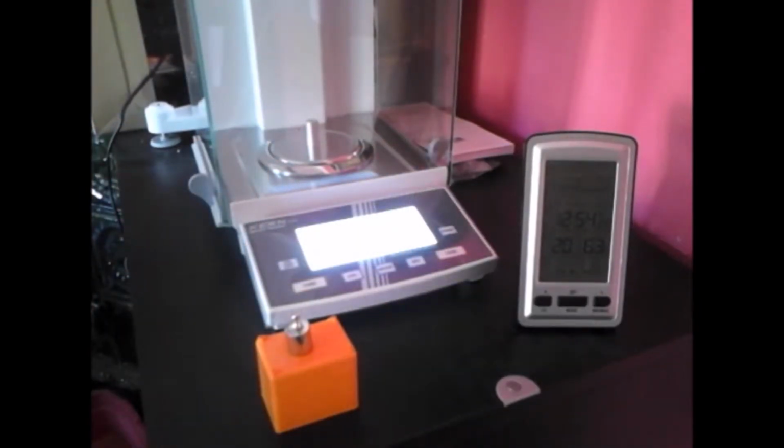After drying, the sample is brought to the balance. The balance is placed in a room with controlled temperature and air humidity. We try to keep temperature and humidity constant. For comparison, we always also weigh the standard weight. This first measurement of the weight will give the starting point of the final curve.